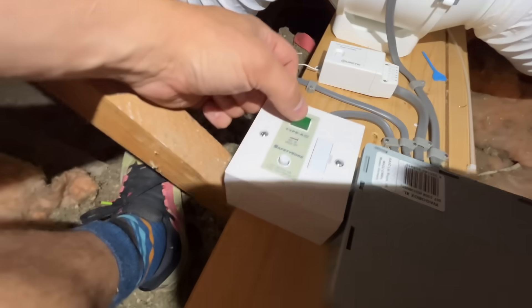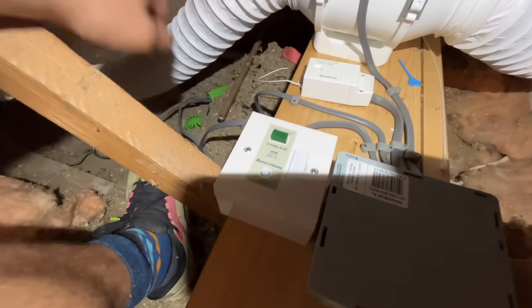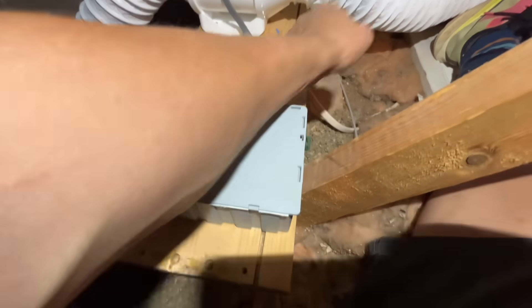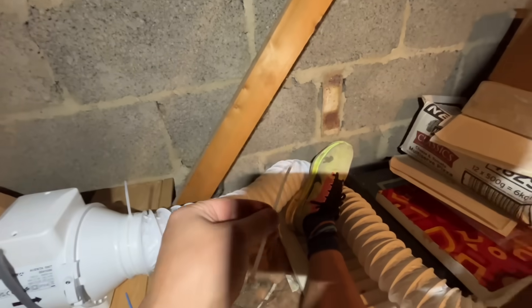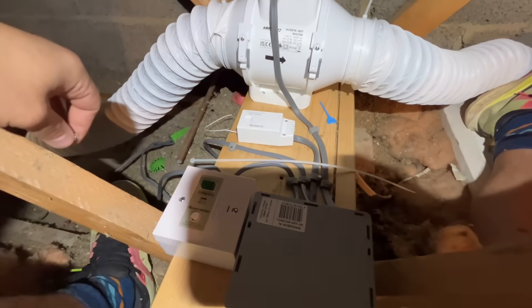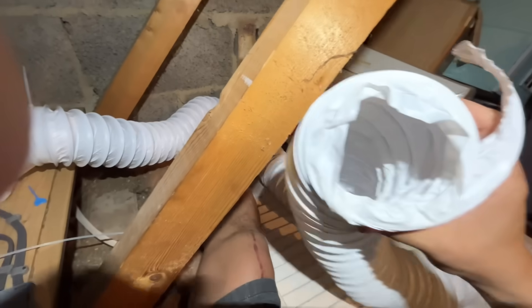Three-amp fuse in. Trip set. Come and try the switch, mate. Right — so I said that wall there we can't drill out because that's in the next-door neighbour's loft. So the plumber or roofer is going to put a vented tile in here instead. There you go — fan's running. Oh look at that, that's lovely. It's quite nice, like having a fan up here.